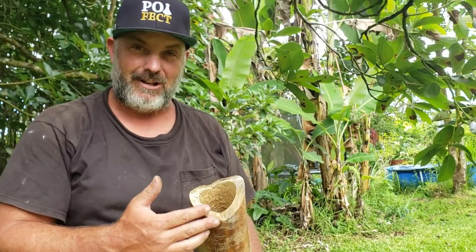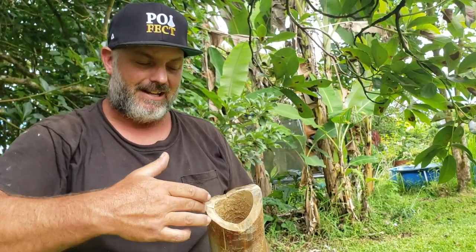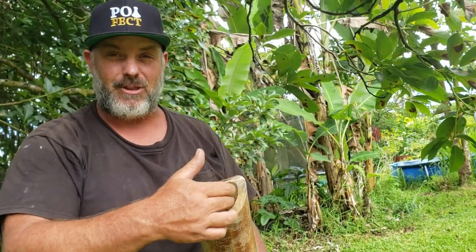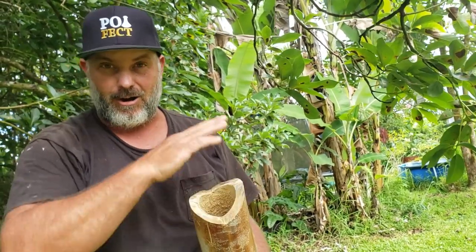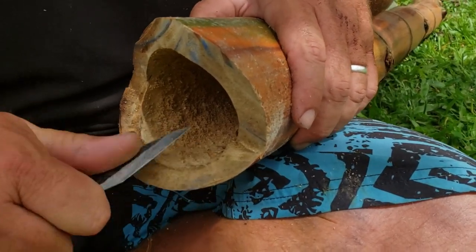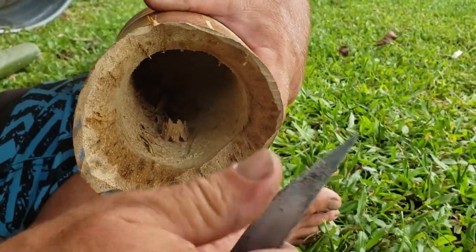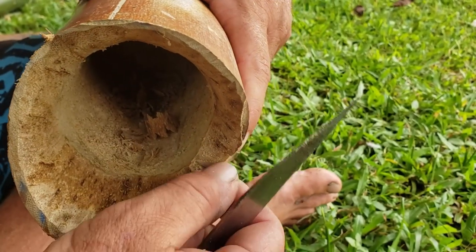This is a rough fish mouth joint. It's not really going to have the bamboo fitting real flush in it yet. This bamboo needs to be kind of carved down. We need to make these high sides thinner and these low sides flatter so that the bamboo has a nice cup to fit right into. You can use a grinder to grind that out, or you just have to carve it by hand with a bamboo knife. So we're going to carve this by hand and get it ready for our horizontal piece to fit right inside. We want to thin out the tops and flatten out these lower areas, and our fish mouth joint is ready to go.